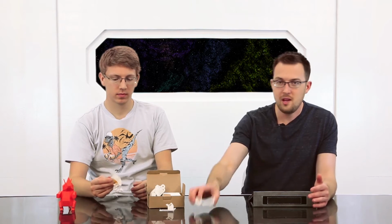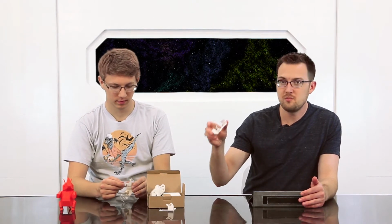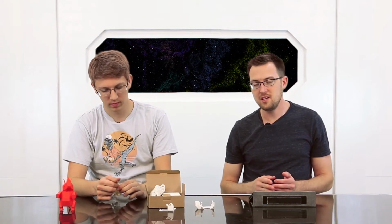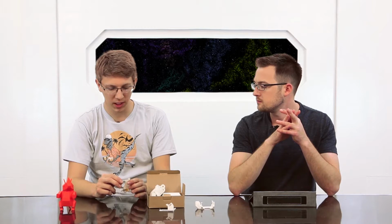So ABS is better for 3D printed parts on a 3D printer. PLA is okay, but ABS is going to be better, especially if it's anywhere near the extruder. So you can do PLA parts maybe for brackets, that sort of thing, something that's not going to be near a heat source. Yeah, and Eric actually did cat fill on this.